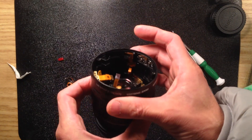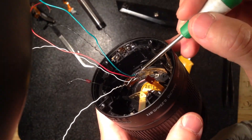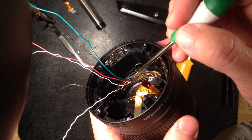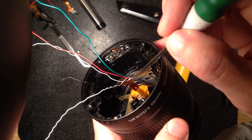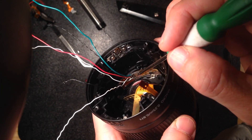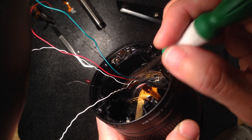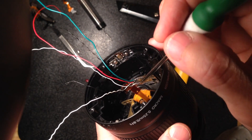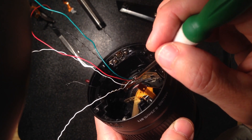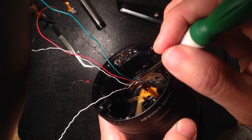So now I have to fix this wire. Fixing the wire requires very meticulous, careful work. My solution is using six thin wires to solder from the base. Because if you solder from the pipeline lines, that is almost impossible — it's too thin. The only option is to solder from the base. As you can see, the base still has six small dots here, and you have to do very clean, careful soldering.